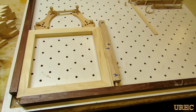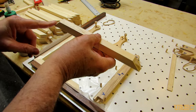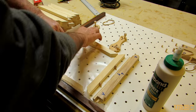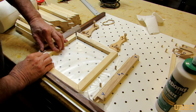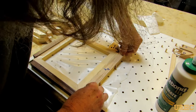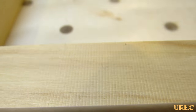I went over to that little clamp board I made that uses my router clamps — I designed and built it a while ago — and that makes squaring up and gluing little frames really easy. Like I do with all my projects, I use Titebond 3; it seems to be a pretty good glue. I spread it evenly on all mating surfaces, push it up against the two square corners, put the slide clamps in, and then a couple of rubber band cam clamps to hold everything together. A couple minutes later it's set up enough to remove.